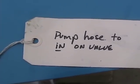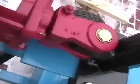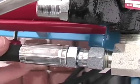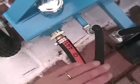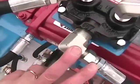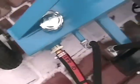There was a little tag in the box that said pump hose to in on valve. So this was the pump hose right here, and I attached it to in on the valve. It takes a 7/8 inch wrench. You'll probably want to use two of them, one to hold this as you lock down this. This hose here was not connected to anything either when it was shipped, and there was only one thing still not connected, and that was out on this valve. And it makes sense, the outlet from the hydraulic valve goes back to the return on the tank.